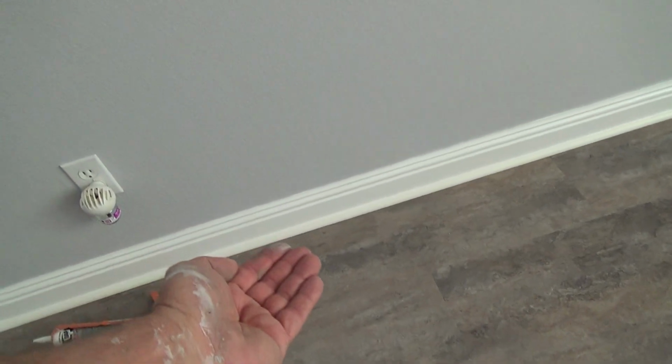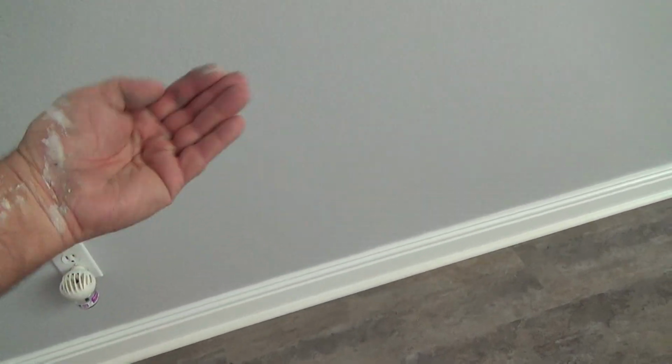Okay. And to remember, I've got the caulking underneath that too. So now I've got 2 layers of caulking holding that quarter round down. I mean, yeah, if somebody got a shovel from underneath and lifted it up, it would have a tendency to want to swivel up. But nobody's going to do that. It's down for looks. It's down to finish the flooring.